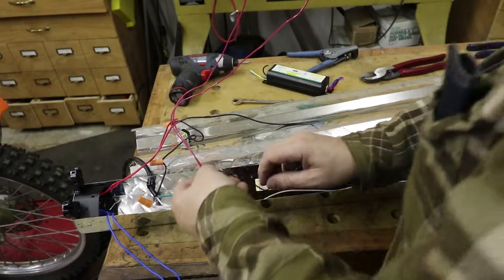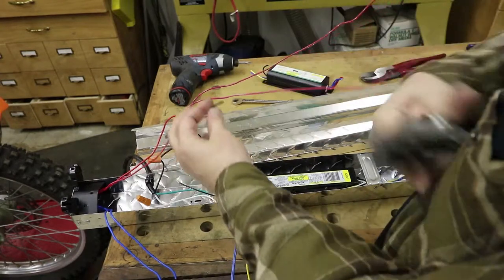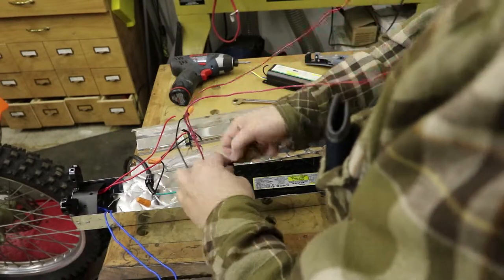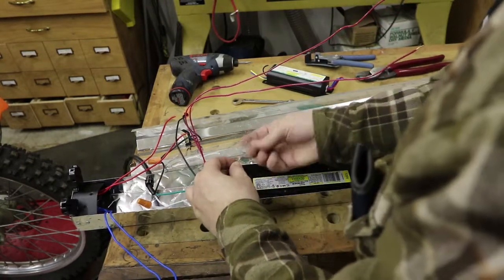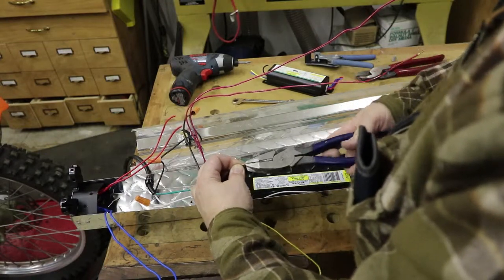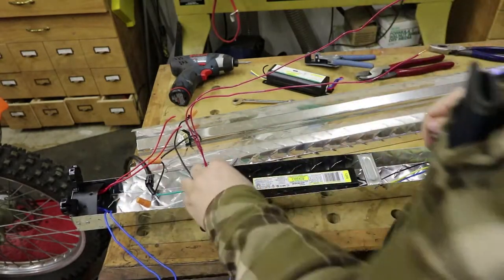There's lots of extra wire length; I'm keeping it in here — I don't think it hurts and it's just easier to deal with. Next I'm going to hook up the hot wire that I cut earlier. This is where these wire strippers come in real handy — put it on the wire size, boom, stripped. So these two get pinched together. When you're using wire nuts it's always handy to squish them down nice and tight — this is where lineman's pliers are really nice. Okay, that fits good, so the black wire is connected and my power is set up.